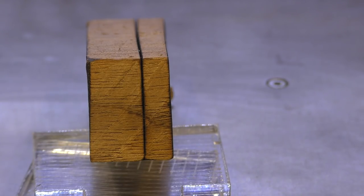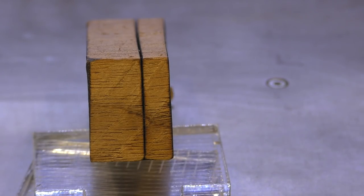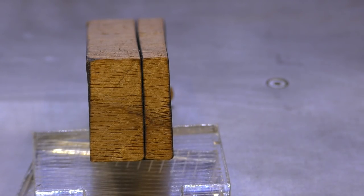It mixes with oxygen and turns into various oxides, it leaves a carbon film behind, it does all sorts of things chemically. But look — it's not doing anything chemically out where the beam should be broadly; it's only happening right down the center of the beam. Damage is caused by light intensity, not by power. So we might be throwing 70 watts at this, but that doesn't mean I'm getting 70 watts of power at that point — I'm firing light intensity down that center point to cause that damage.